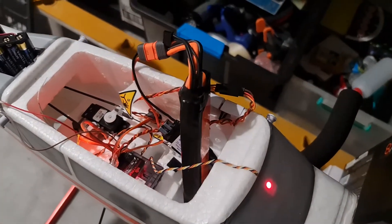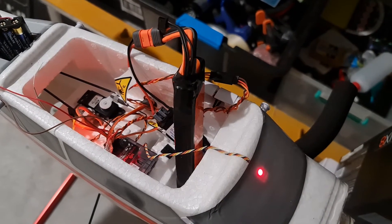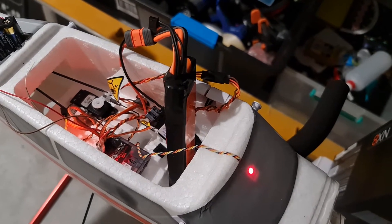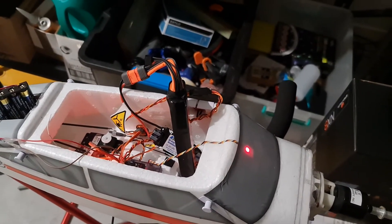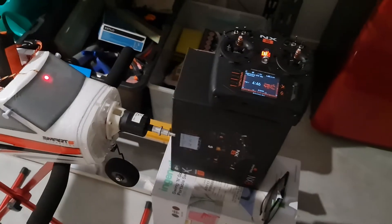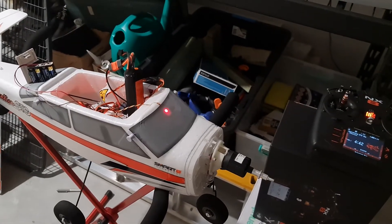Let's plug the battery in. Batteries plugged in — full throttle, half throttle. There we go, programming mode. Alright, we want menu number 3, the timing.